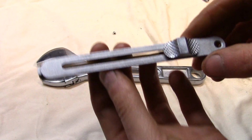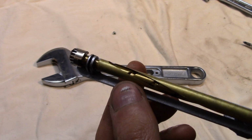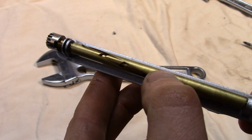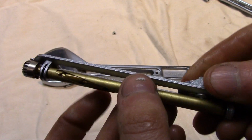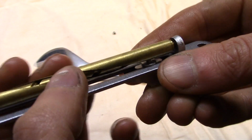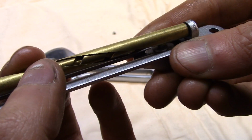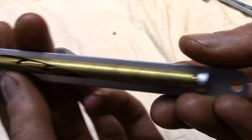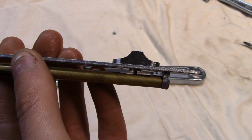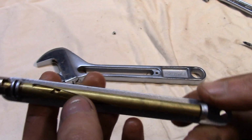Here's the mechanism, and on the back side you can see the secret. There's a spiral cut shaft in there, and there's this tube that goes over it with a slower spiral that doesn't really attach to anything, and my best guess is that it's some sort of a dust shield, so it helps keep the dust inside the mechanism so it jams up faster. And the slider has a little peg that engages the screw, or that's not a screw, whatever you want to call it.